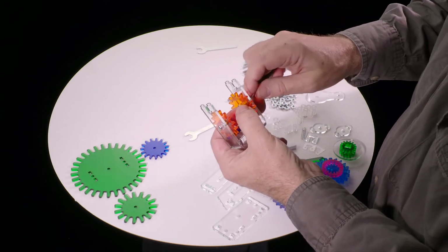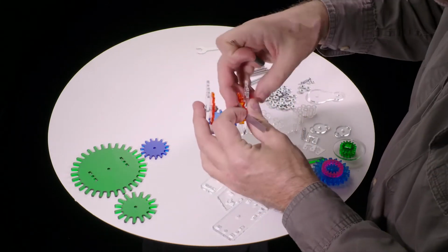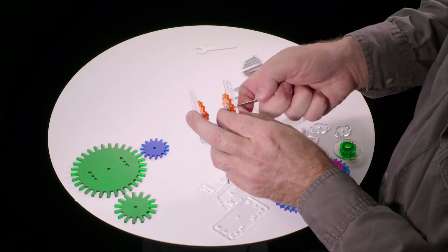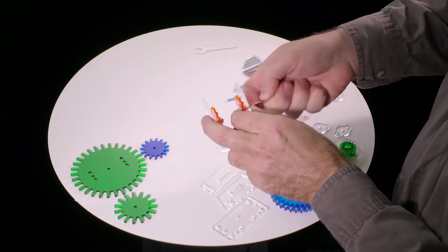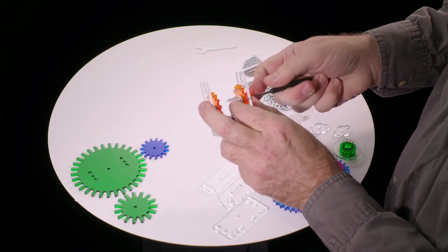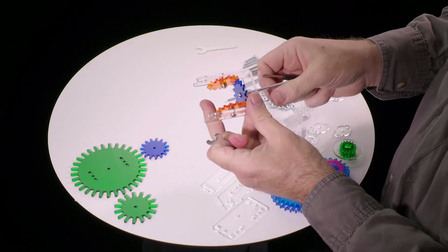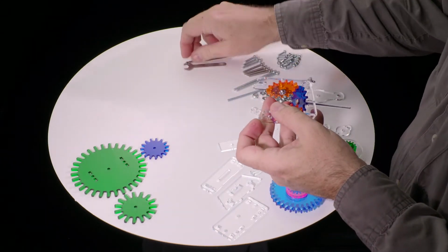Okay, spin it on to the point where you can't hold it anymore, and then using a wrench, sort of awkwardly hold this and tighten it. Again, until it's tight, and then back up. It's really less than half a turn. It's just enough so that it is free to spin very easily, like that.